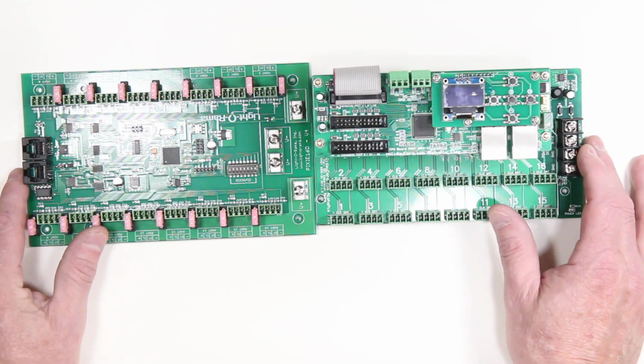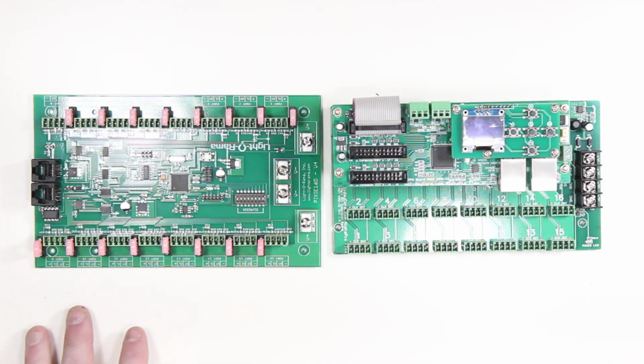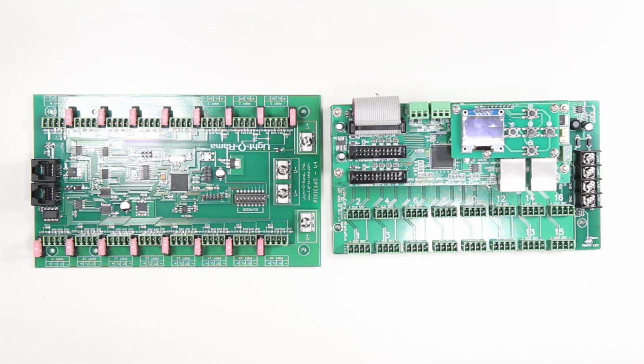This is a technology from the early 1970s designed for industrial systems, and it was really a great thing back in the 70s and 80s. And in the late 1990s, Light-o-Rama, when they designed their system, designed it primarily around RS485. Now, this is great when we have very low amounts of pixels, or as it originally was designed for, just 16 channels.